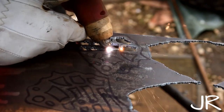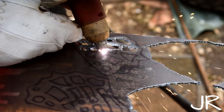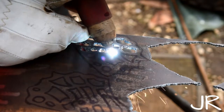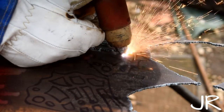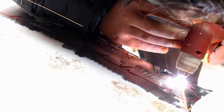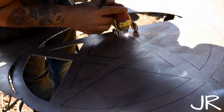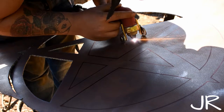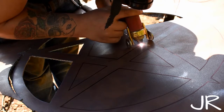The plasma cutter is one tool I would not be without — it gets used daily. A plasma, like a grinder, can cut almost any material, granted you have a high enough amp setting, or a really good plasma like an Oxford or a Hypertherm, which despite its amp setting will allow you to cut thicker material, heat up, or gouge. I use my little SIP HG400 and for the work I do it's crucial. It allows you to save on materials, is cheaper on consumables than cutting wheels, cuts quick and clean, and gets into tight cuts — like cutting a tight circle, piercing for a plug weld, or even cutting letters out of sheet metal.